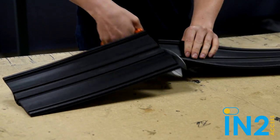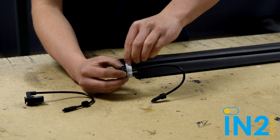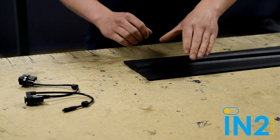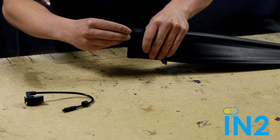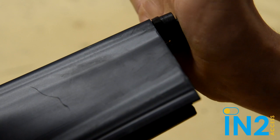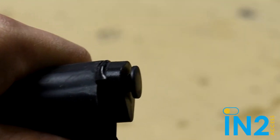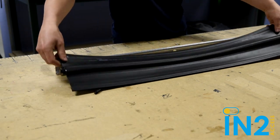Next step is mounting the contact end pieces. What I like about Expert Line is the sealant is built right into the contact end piece - no need to apply it separately. The unique saw-tooth pattern ensures a secure multi-point connection to the integrated contact strip. So fold the rubber profile in half, and when you push the contact end piece in, make sure the sealant overflows out - or 'ooze out' as we'd say in LA. Bercher's term is 'overflow'. I think I like 'ooze' better. Me too.